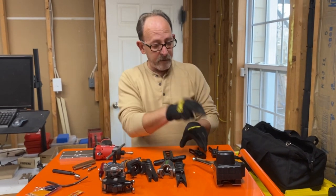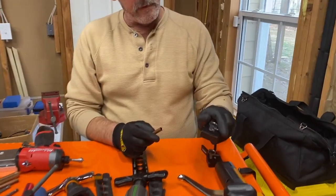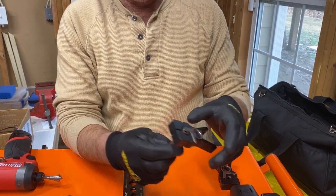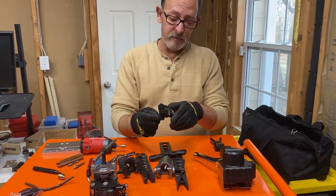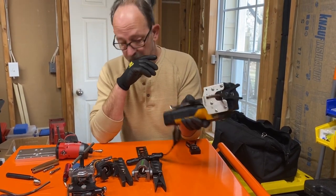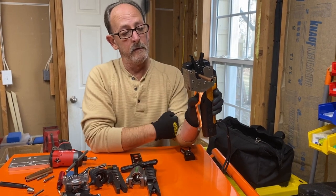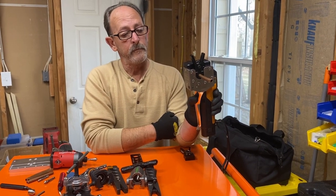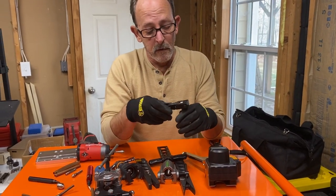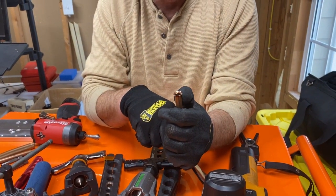So I'm going to go ahead and use the Navac battery powered flare tool because it's just the easiest. So you want to take your finger like this and hold in and push in on the copper to where it's just hitting that stop, right? And you can do a flick test to see if that little stop moves. Then once you do that, you just stick it in there like that. You push the little black button to let the head go out. It's going to stop, and then it's going to come back in. So we just made a flare, right? And this is the one that was made by the battery powered tool after the countersink deburring tool, so there's no scratches on the face of the flare.